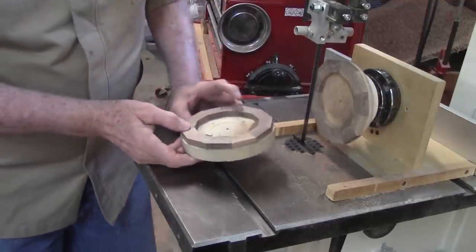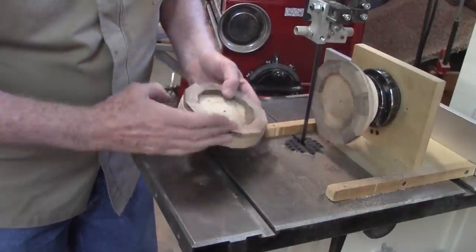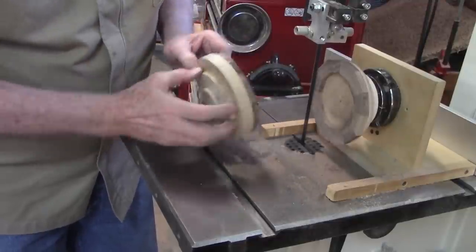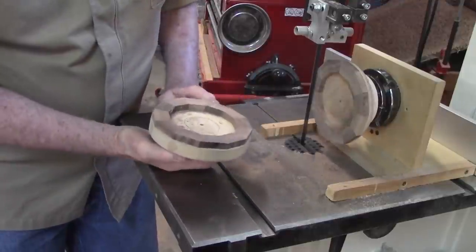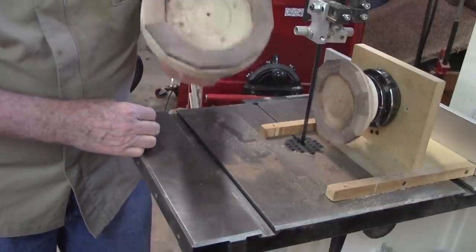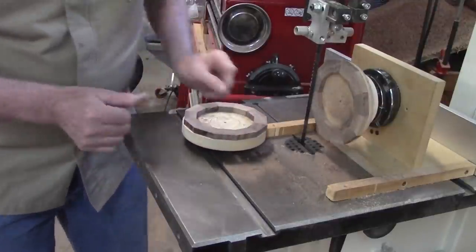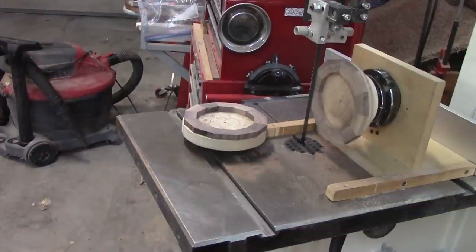One of the advantages of having it this way: if you don't get the spinning action — when you cut something round on the bandsaw, that blade will grab it and spin it right out of your hand. This way it holds it from spinning, and that cut is within five thousandths of truth. Some people wondered why you even split a ring in the first place — why not just mill the stuff down thin and then glue up the rings? What's your take on that? It depends on if you like to glue rings.